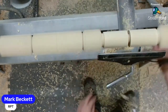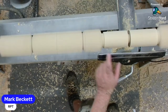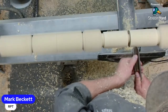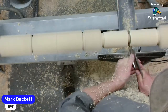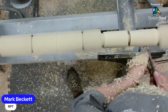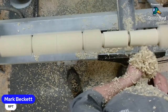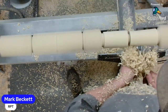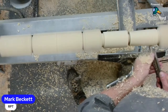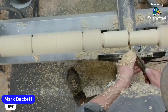What I've done there is I've just sized these down to my maximum diameters. This end and this end are the maximum diameter, and that's the maximum diameter for the thinnest part. I do get a bit of vibration off of this - I do most of it with a spindle roughing gouge. If everybody notices, on his right-hand side that's the tailstock, and he's working back from the tailstock towards the headstock. That way, when he gets the thinnest part of the wood down at the tailstock, he's still got a lot of support back at the headstock to cut down on the vibration.